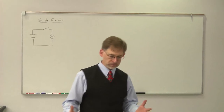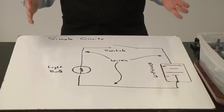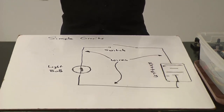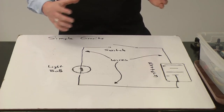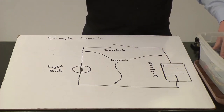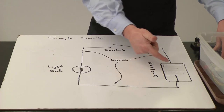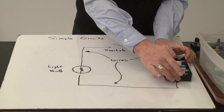If we look at the simple circuit, we're going to build a circuit here to give you a sense of what we're looking at. When you build a circuit, what you'll often notice is that in circuit diagrams, actual physical objects are given symbols so that somebody who knows how to read a circuit diagram can very quickly see what's going on. A simple circuit has one power supply — in most cases something like a battery or a generator. Those are always represented by a series of alternating long and short lines, with the long lines being positive and the short lines being negative.